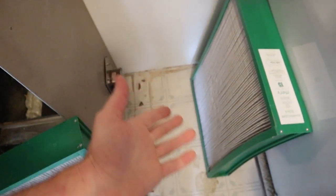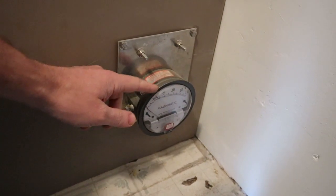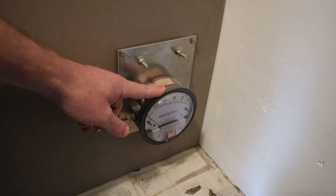Over time, as these things deteriorate, you don't want to damage your central air conditioning equipment — excessive filter resistance is apparently the root cause of 75% of HVAC service calls, which are horribly expensive. You can know whether or not you have too much resistance here. This gauge should be mounted in an easier-to-read location, but I didn't want to buy tubing so it turned into kind of a hack job.